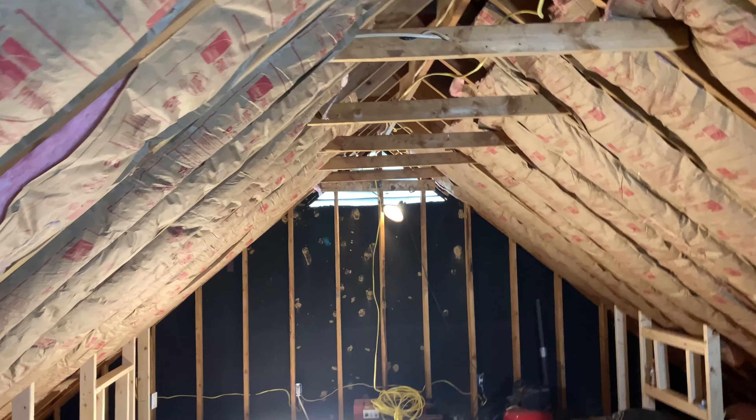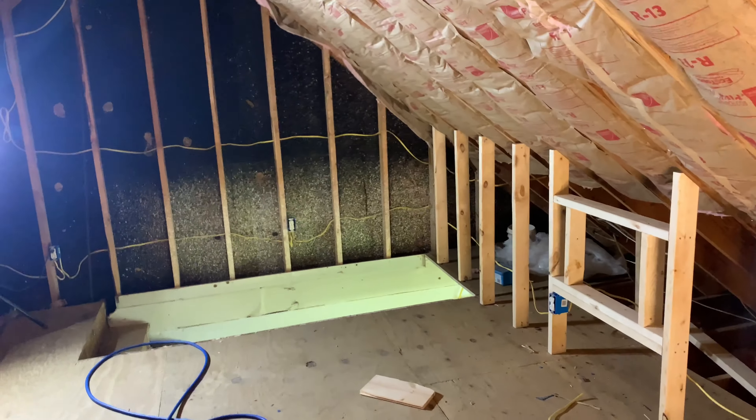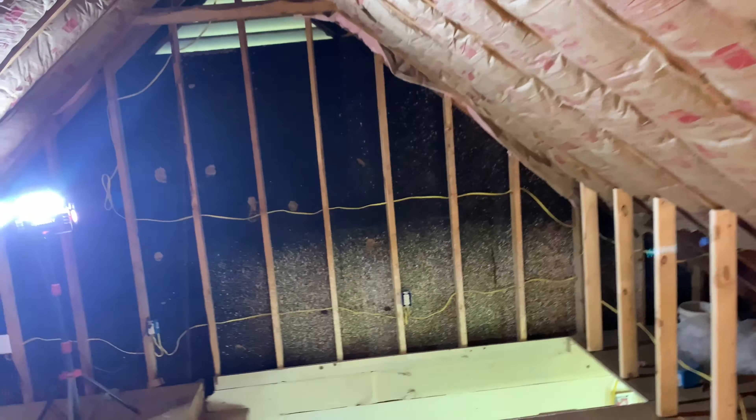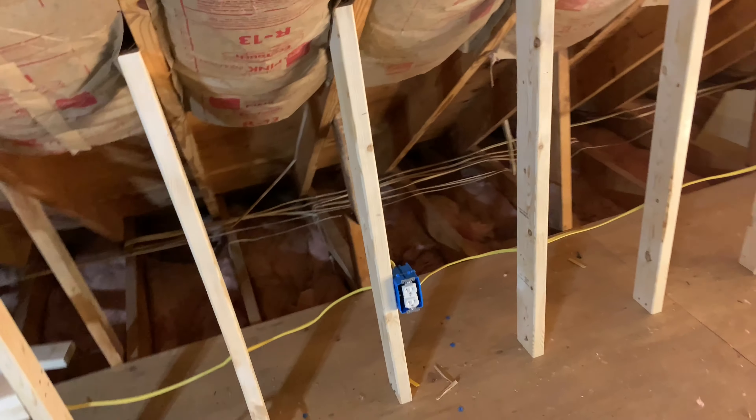That's the hard part right there, so from here it gets easier. We're going to insulate this front wall, the back wall — probably just a single layer there. I might go ahead and put a double layer on this knee wall just because some of the roof is still exposed down in there, and heat is going to emanate from there and want to come through that knee wall. Even if I don't have enough material, I'll probably do a double layer just because it's going to need a little extra.